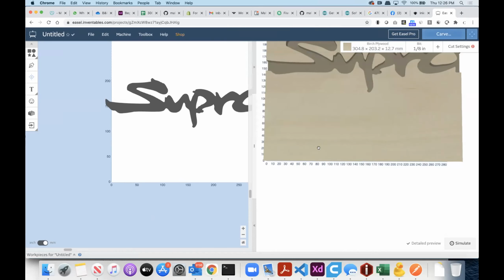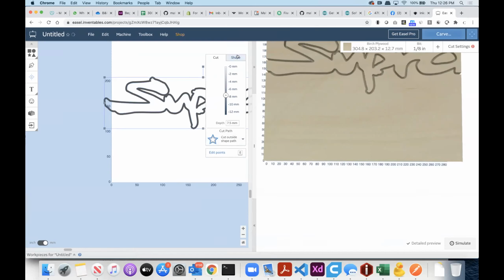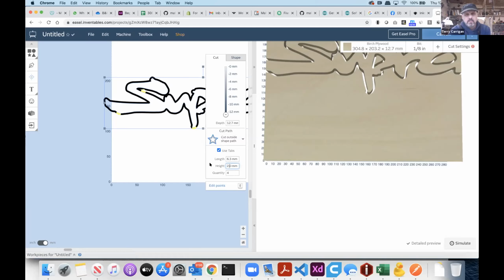to your thickness. One thing to keep in mind though, if you do that, say I do a cut on the outside and then I go into my depth. Once the depth reaches the actual thickness of the material is when I have an opportunity to generate those tabs. So if you're doing tab generation, make sure you compensate for that extra thickness in the height of your tabs, so that you don't end up doing a full through cut and your piece falling. Yeah, that makes sense.